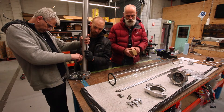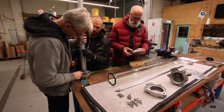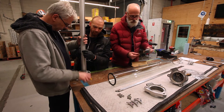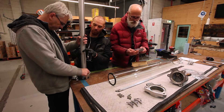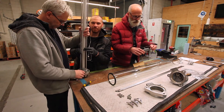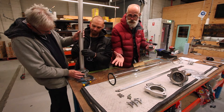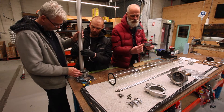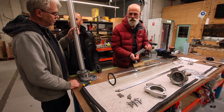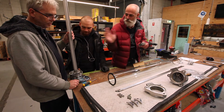More importantly, we have the driver here, which is 24 volt. This one will take an input of between 100 and 240 volts, so it is used pretty much in every country for every voltage — it will make 24 volts out of whatever mains you've got in whatever country you are. This is also a Triac dimmable driver. Triac essentially means that you put a regular dimmer — a knob or whatever — on the mains and it will control the output for the LED itself. This makes it simpler to wire and a lot less complex to consider if you've got a retrofit. If you've got an existing lighting circuit with an existing dimmer, this will allow you to dim this light.